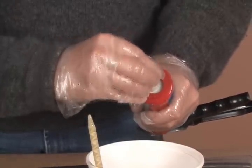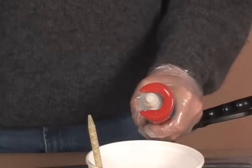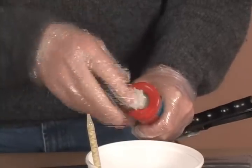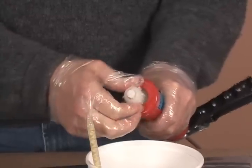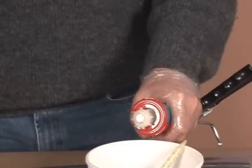When ready to use, remove the end cap assembly and check that the orifices are clear of any hardened sealant. Attach a new unused mixing nozzle. Tighten the nut and insert the used cartridge into a high-ratio caulking gun.